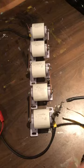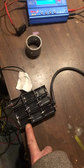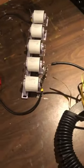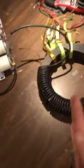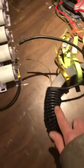Now this is the disruptive discharge capacitor, not the self-run situation with the big capacitor. This is just the four microfarads and a spark gap, and these are getting charged from here using this neutral. Because that's an artificial neutral to this neutral — which is an elevated ground plane from this artificial minus 5,000 volts — we have that as our ground reference.